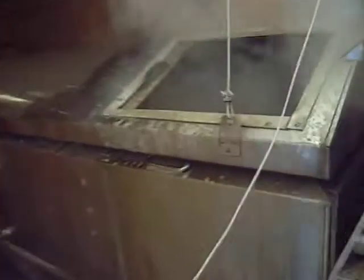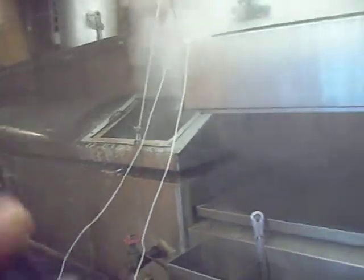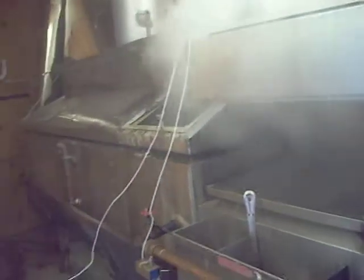The evaporator has a back pan, which is called the flue pan, and then we also have what's called a cross-flow front pan. And the flue pan, you're probably not going to be able to see a whole lot, but there you can see the boiling sap. The flue pan has a corrugated bottom, very deep channel, so there's a large heat transfer there. You get a lot of boiling because there's a large surface area.